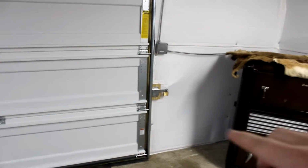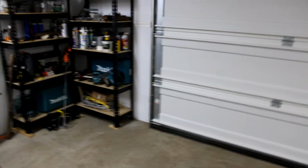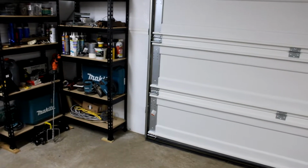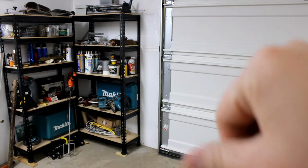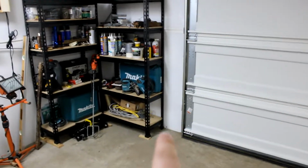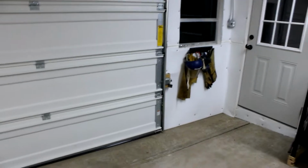The wooden 2x4 frame also has a seal that runs across the bottom on both sides of the door, and those are anchored to the concrete with some anchor bolts, for lack of better terminology. They're the kind that you drill through the masonry, through the concrete, and you hammer them in, and then it's got this flange that opens up and it anchors it in there, and then all you have to do is put a nut on the top and it joins the bottom seal to the concrete very tightly. And of course we've gone around with sealant around the entire perimeter of the garage against the concrete as well. So yeah, there and on both sides of the front garage door, here and here, it's all anchored in.